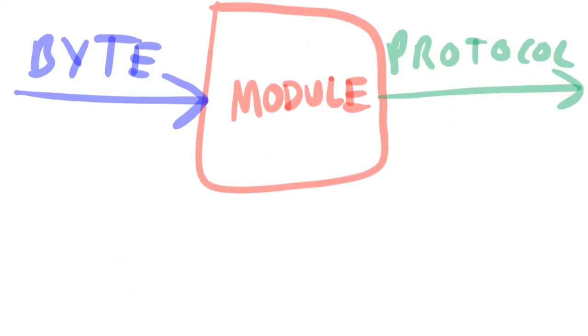So usually it's more advisable to use the hardware in a microcontroller or some embedded system than to bit bang. Hardware handles all of the protocol semantics, and you don't really have to worry too much about it being overhead on your processor because it all happens in the background. Bit banging is, for this reason, inadvisable in many applications, but sometimes you just don't have enough serial ports, or you don't have the type of serial port you want.